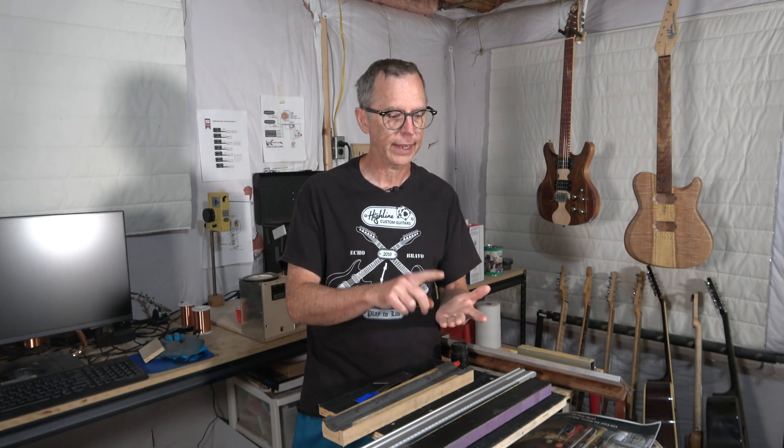That's the first part I'll be cutting on my CNC machine. I always cut all my parts on the CNC — the fretboard, the neck, and the body — and I like to follow a very specific order. I start with the fretboard, make it all the way to completion minus the frets, then make the neck all the way to completion and bring the two together. If you glue a fretboard blank to a neck blank first and run into a problem — a mistake or a flaw in the wood — you've lost both parts. The way I do it, if there's an issue, I've only lost one part. So it's a cost-effective measure.